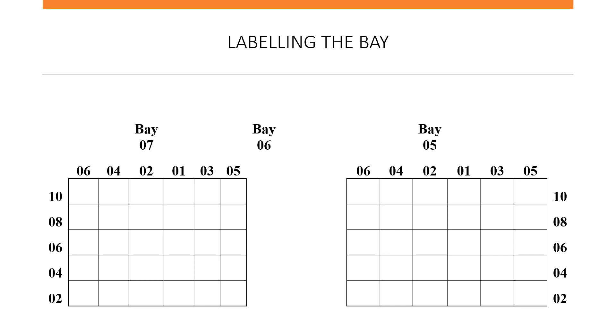We will begin by first stowing the 20-foot containers. After putting in our rows, we have found midship, with 1, 3, 5 to starboard and 0, 2, 4, 6 to port. We have also labeled the tiers. Remember, it is very important to always label your bay — it is a guide and helps you indicate cell addresses, such as 05, 02, 04. It guides you and prevents mistakes.